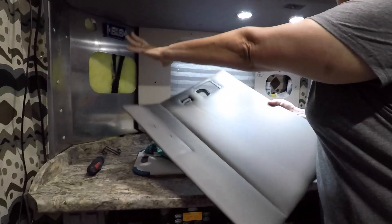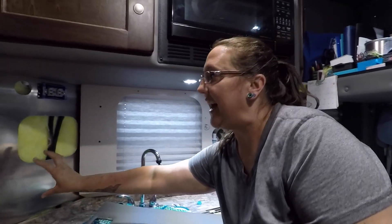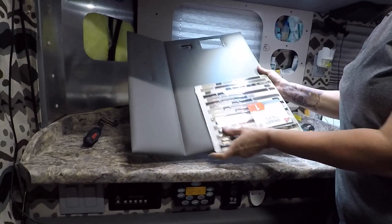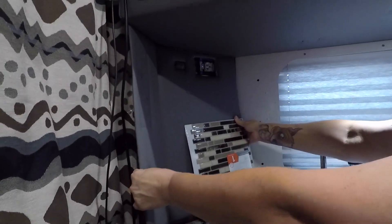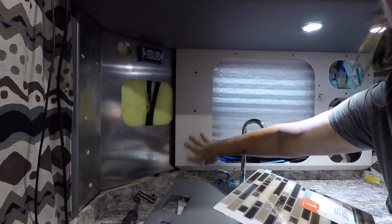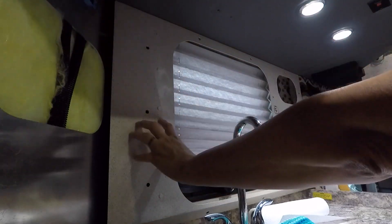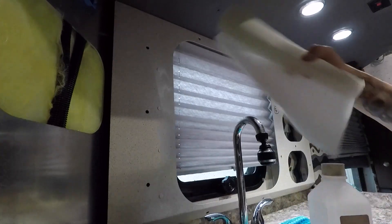When we pulled this piece off of this wall over here, there are cutouts where you can see the insulation, the cords, and some bolts or rivets in here. So what I've decided to do — instead of sticking the tile here and having problems with it — I'm going to use the piece that came off and actually tile this vinyl piece. I'm going to clean it really well, do the tiles on the vinyl piece, and then put the vinyl piece back up where it came off originally. But I am going to use the Smart Tiles and stick them directly to this metal as well. So now we've got everything down and we're going to clean — we want to clean the surface off really good. I'm just going to clean this and then clean the vinyl piece using some rubbing alcohol and paper towels.